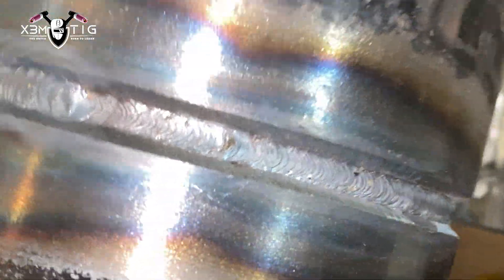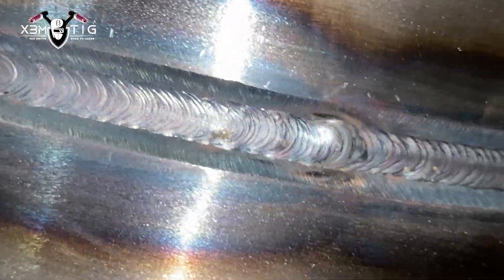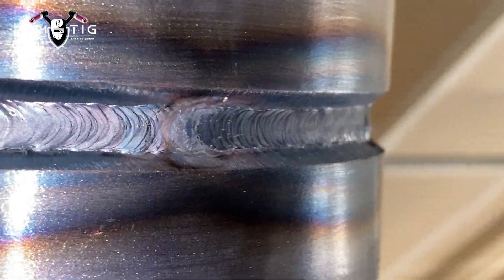Before I reach that spot I'll pause here, make sure both edges are properly consumed, add wire as needed, then go over and dip a couple more times to finish it. That's it from the outside — that's the root pass. I'm still not going to remove the end cap to check inside; I'm pretty sure it should be okay. That's the beauty of keeping the cover — you don't see what's going on inside, which is good for practice.